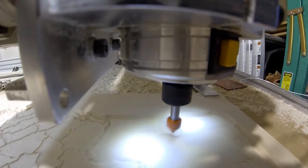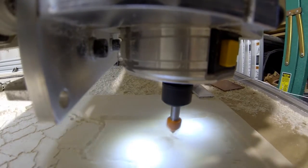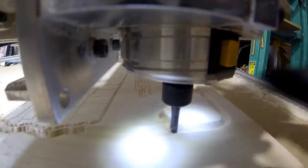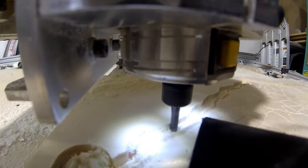And here I do it again on the right side where I engrave a compass rose. It's very fine detail, and I was afraid that if the material had any kind of crown, it would not look very good. Now I've changed over to a 1/4-inch end mill. It's carving the piece around the edge, and it's actually carving outside that original chamfer.